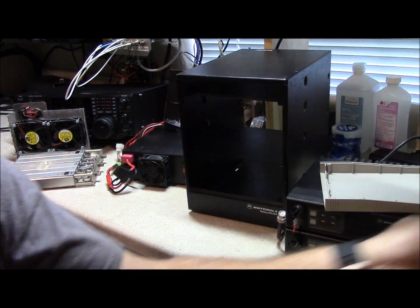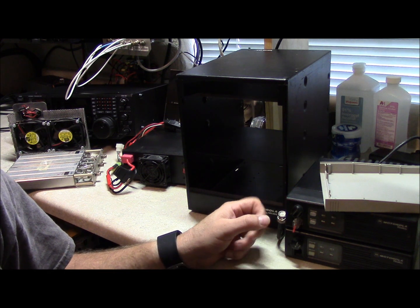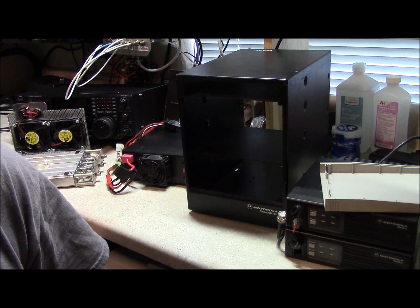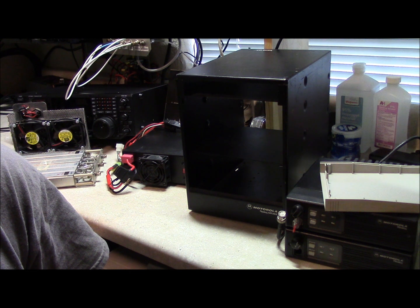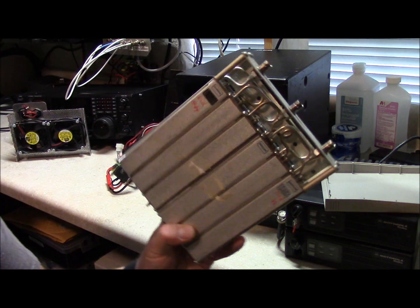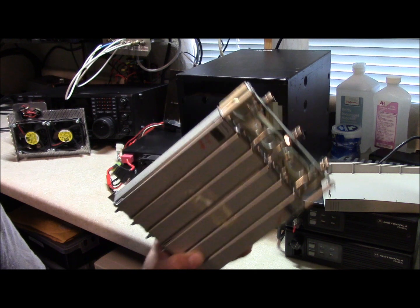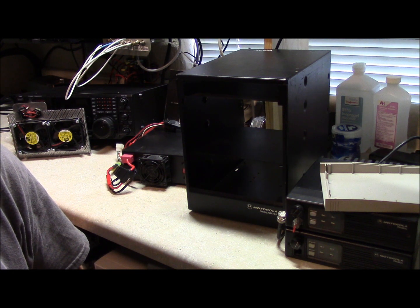Down and dirty, you can dispense with a repeater controller. You'll have to build a hardware solution with a cable to attach your transmitter and receiver together and route the audio back and forth to toggle it to transmit — there are circuits you can build to do that, but it's radio-specific. A lot of your more modern amateur radios even come with onboard crossband repeat functionality. You can also dispense with a duplexer if you have enough physical separation between two antennas — a transmit antenna and a receive antenna. It's easier to do at UHF because of the 5 MHz offset; with the VHF 600 kHz offset, it's a little more difficult.